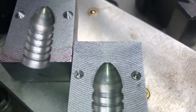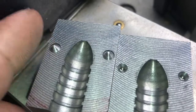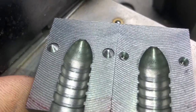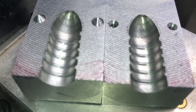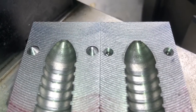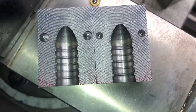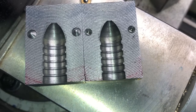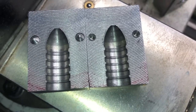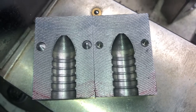Next video, next step will be drilling and tapping all the holes in it. It would be easiest to do all of that while it's set up in the mill after you've cut everything square off the front end of the blocks, but that's a lot of work if you're not happy with the bullet design — then you've just wasted a bunch of time. Anyway, one more look at the bullet design: I think it'll shoot. I wish that top lube groove wasn't quite so deep, but we're going to cast them and see how they shoot. If they shoot, we'll stay with it; if they don't, we'll chuck it up and bore it out to a 50 caliber.